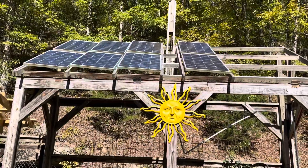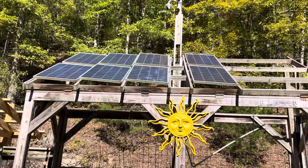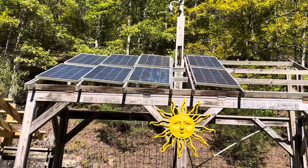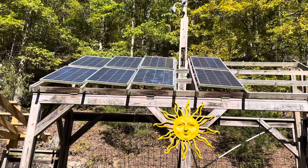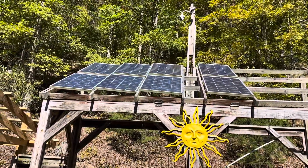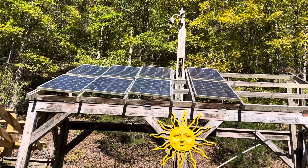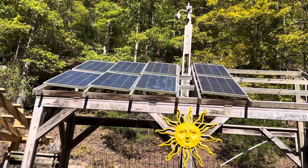I have four panels on the left and four panels on the right hooked up in series. These are the Alt T 100 12M solar panels — 100 watts each, and there are eight of them. The four on the left are wired in series and the four on the right are wired in series, and those two strings are in parallel with each other, giving me 60 volts. At 15 volts per panel times four that's 60 volts, and paralleling the two strings doubles the current from 5.5 amps to 11 amps, for a total combined power of 800 watts.